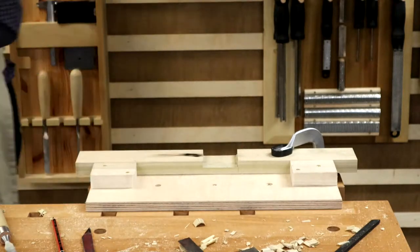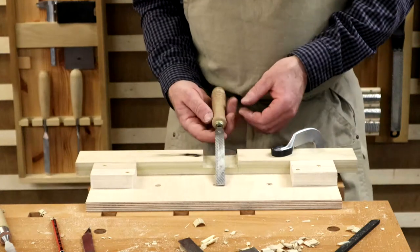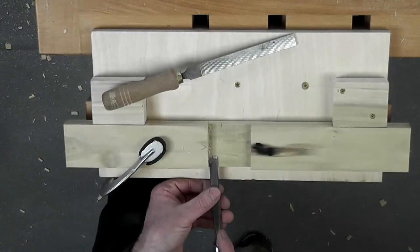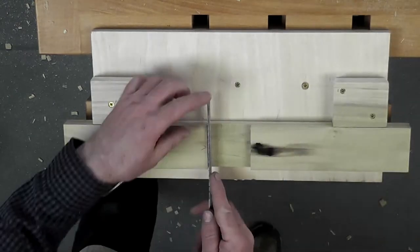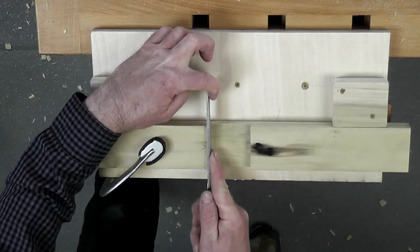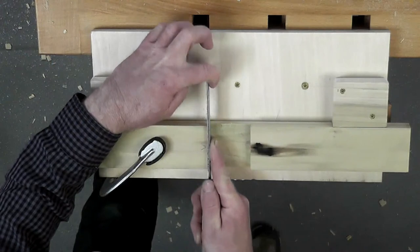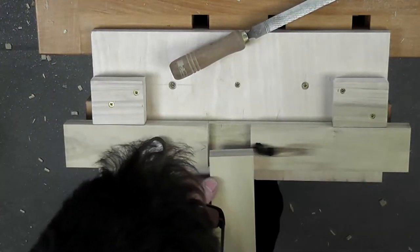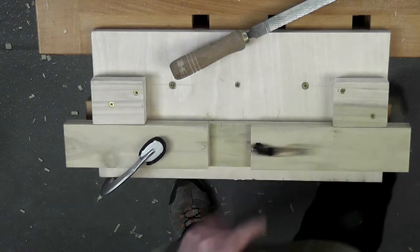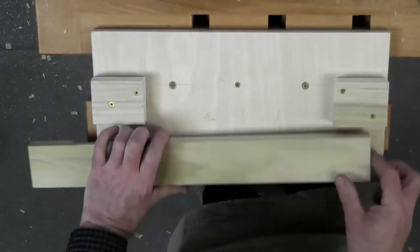Nearly going in. Okay. Fine adjustment tool. And we talked about this when we did the hand files and the rasps and stuff. Japanese rasp. So these are carver's rasp. Fine. I said to you about, we can tune up apart from, I don't want it resting on that. Just that face. What I have got to do is get support either side, not push too much pressure, too much weight behind it. Trying to keep everything equal. Slide it across, create that crisp shoulder line. So therefore, that fits in nicely, that's good. So something there is a little bit different. I know when we did the files and rasps, we talked about that sort of thing.